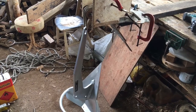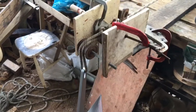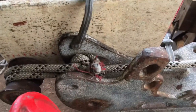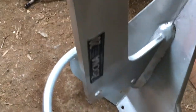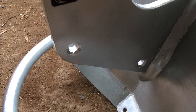That's given us our sizes and we can continue on and modify the bow roller fabrication. We'll also add a small web to either side so that we can put a securing pin to engage through the two webs and also into the aperture in the anchor as that aligns.